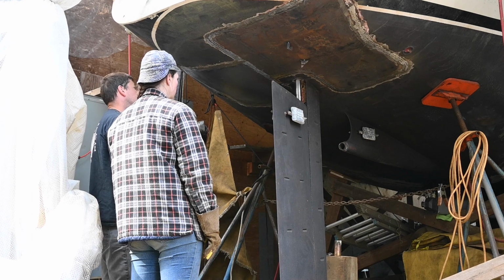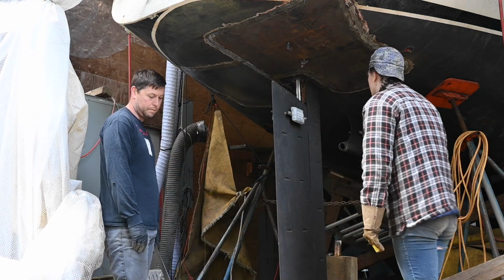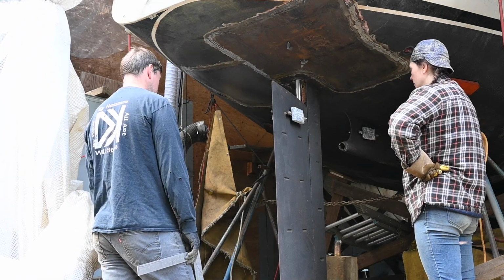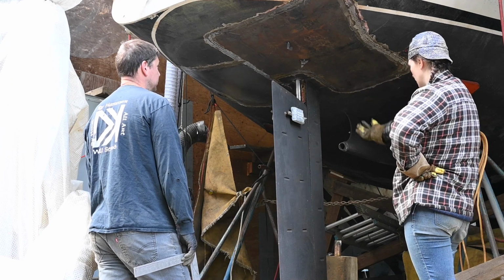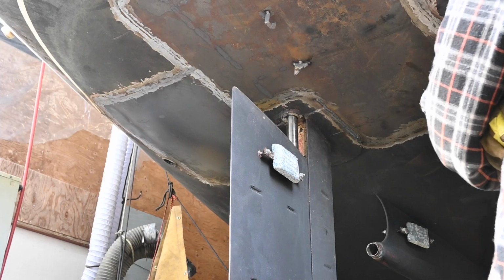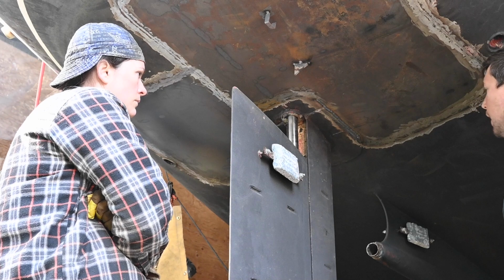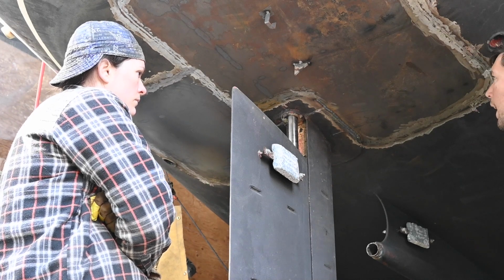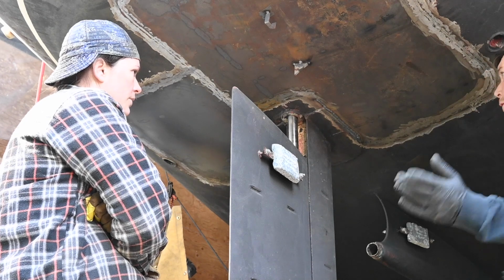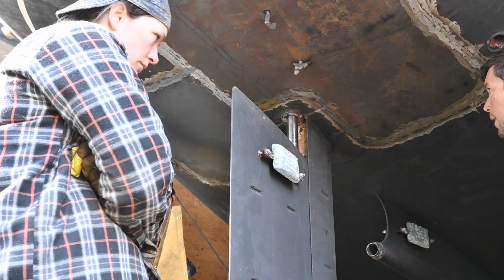You should have braced the thing. We cut too much out of the boat at one time. I mean, maybe if we put some heat into this area, then we could pull it back. Well, I'll tell you what. We can weld a come along on and start pulling it and take the torch up and heat up this area and just see if we can pull it in before we start getting anywhere with cutting.